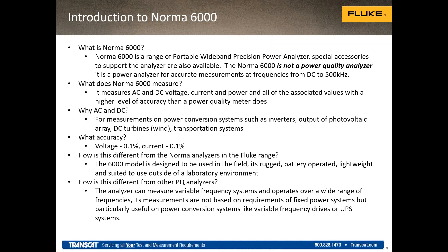As we've made a transition into more renewable energy resources — wind power and solar power — DC is becoming a more major aspect of measurements on a day-to-day maintenance routine, or for efficiency measurements and solar measurements. The Norma has the ability to work with both AC-to-DC and DC-to-AC systems. The accuracy of the Norma is 0.1%, putting it on par with a Class A analyzer, though it doesn't carry full Class A specifications since those require additional measurement parameters.